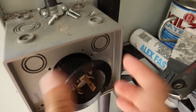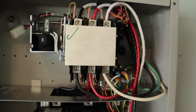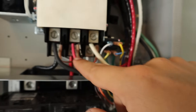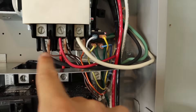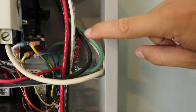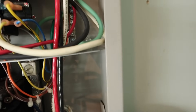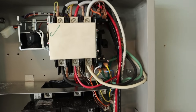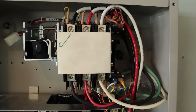After you've got it all hooked up, you set it in and screw in the screws to hold it. When mounting outside, you'd have it face down with a cover over it. The wire from the plug comes down the wall into the box: black mounts here, red goes here, white goes here — these are hot just like the utility wires. The ground wire from the plug mounts to the ground bar in the back. That pretty much sums up how easy it is to install, though it takes time to run the wires and get them screwed in properly.